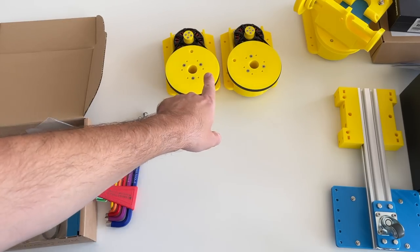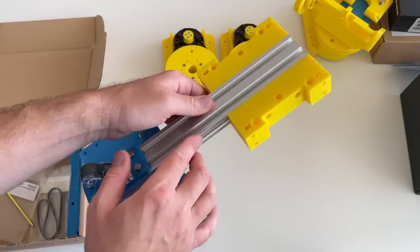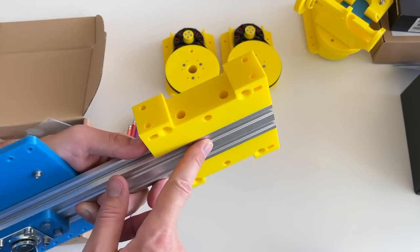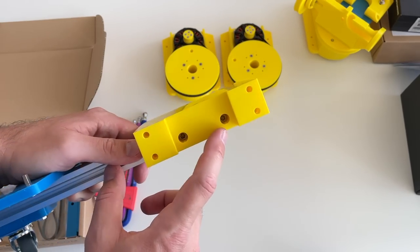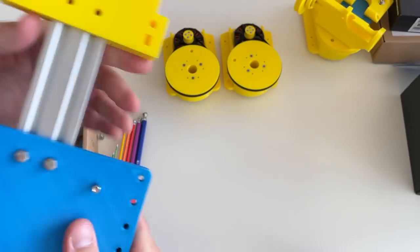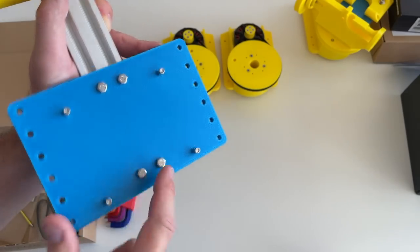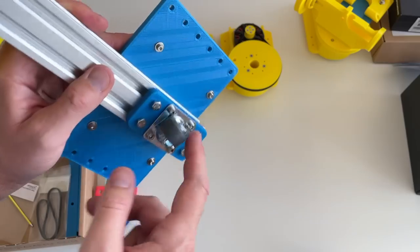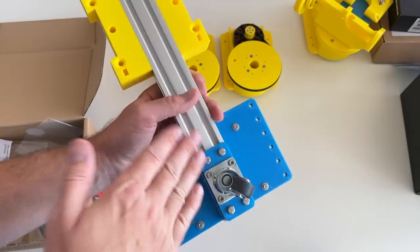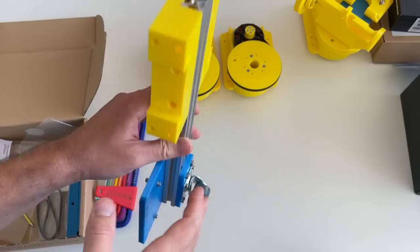Now let's look at where we're going to put these wheels. The frame is made from 20x40 aluminum extrusion with a length of 310mm. I mounted a plate here using 16mm long M5 screws, and there's a plate for the Jetson Orin fixed with 12mm long M5 screws. On this side there is a caster wheel. You don't need to memorize all the screw lengths — you can figure them out from the design, which will be available through my Patreon. I use metric screws and metric nuts throughout.